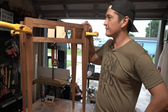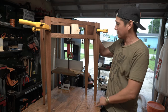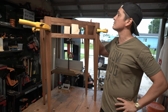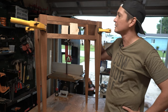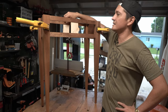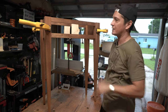I've got this thing test fit — this is probably the sixth or seventh time I've put this together. Off camera, I rough planed everything to get the bandsaw marks off. I'm going to pull everything apart, finish planing everything, and then glue it up. One of the things I'm thinking about is using epoxy as my adhesive. I initially considered hide glue, but I think with this end grain section being so brittle it might just make a little more sense to have epoxy in that joint, strengthening that little zone of end grain where that haunch comes in.